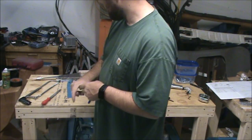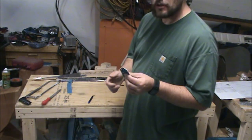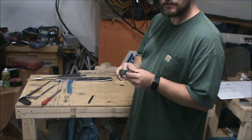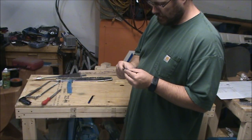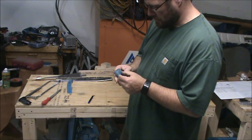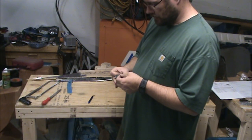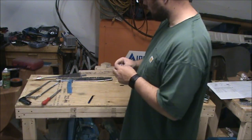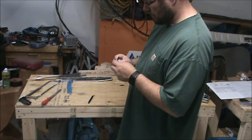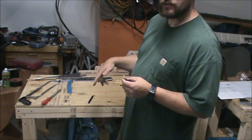One note on the rudder that I was just thinking about is for the trailing edge you need the tank sealant, which is Pro Seal. That does not come with your kit. So I'm thinking, depending on your working speed, you might need to order the Pro Seal.